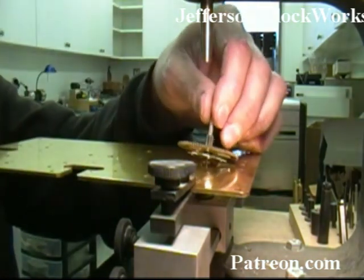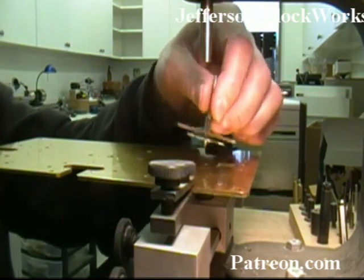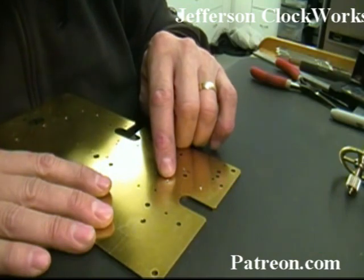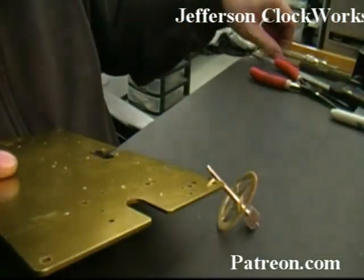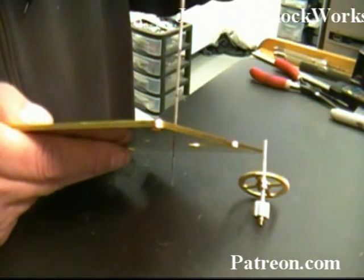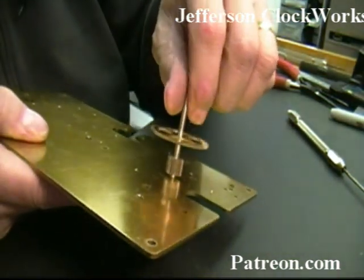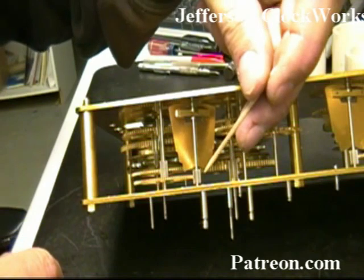This pivot here is going to be married into that little hole — you can see it's really worn out, look at all that tilt on there. There's a nice little gauge you can buy but you don't need it; it just makes things go quicker. We're about to size one of the holes — it's obviously a little bit too small — so we grab our five-sided broach. It's a five-sided drill and you simply twirl it in your fingers very gently. Then we'll check the shake on the fly governor.